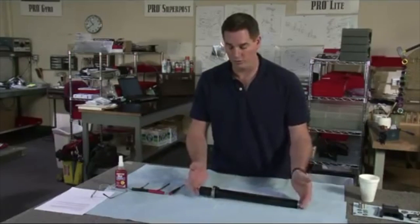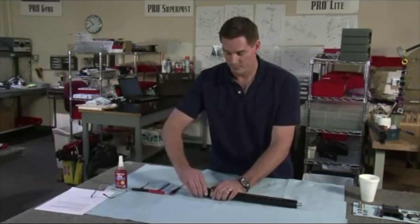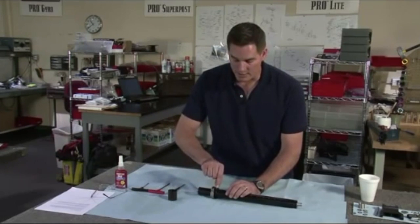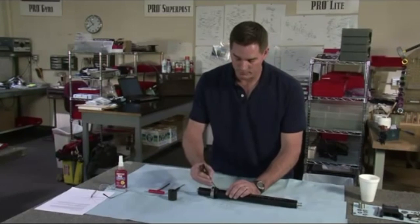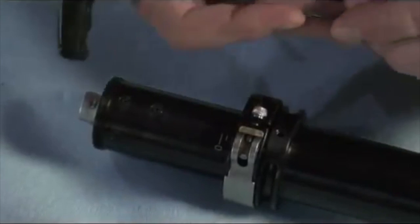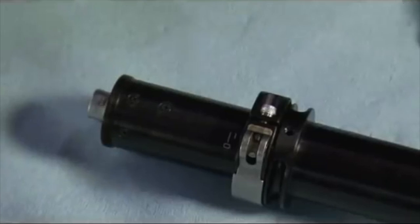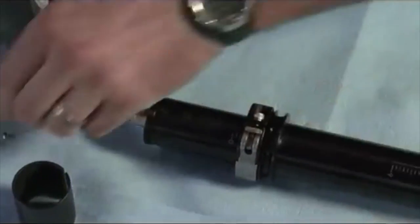First thing you're going to do, you need your center post 2. You're going to remove the monitor arm spacer. Just kind of pinch it up like that. We're going to be accessing that set screw with the 3/32 Allen wrench. We're going to pull him out. Now, if yours has been in there for 10 or 15 years with all your sweat and salt and you never cleaned it, and there are those of you out there, you know who you are, you're going to blow out this hole because Lord knows what's in there.